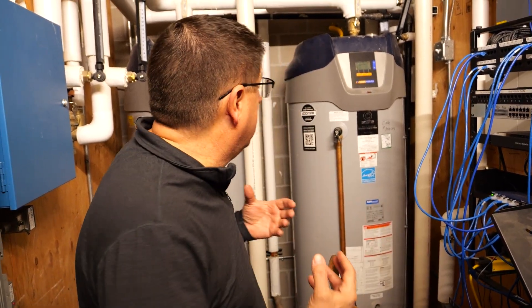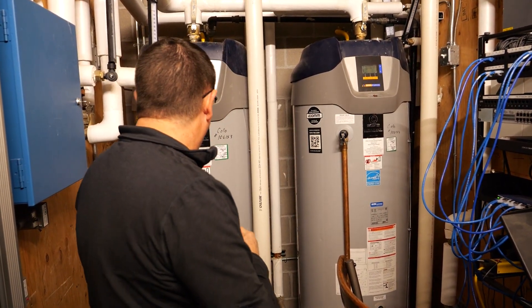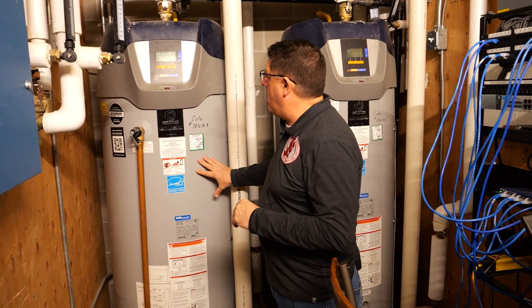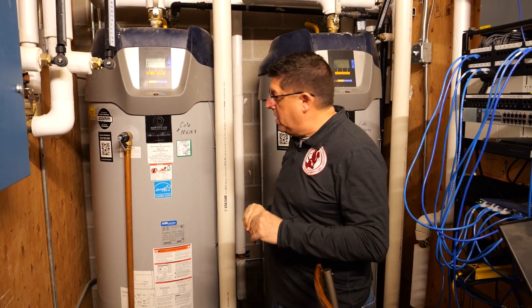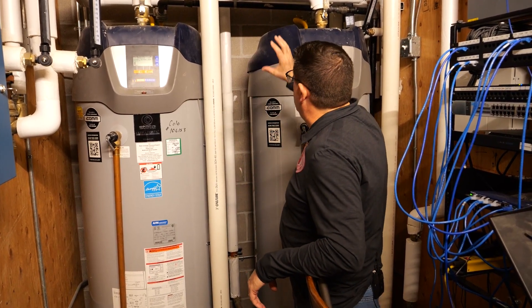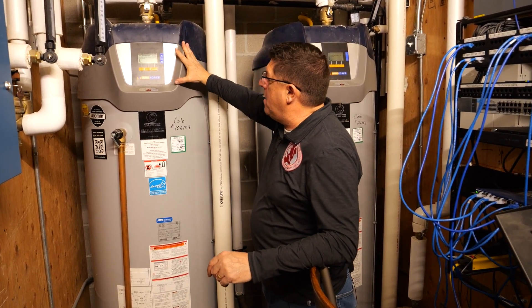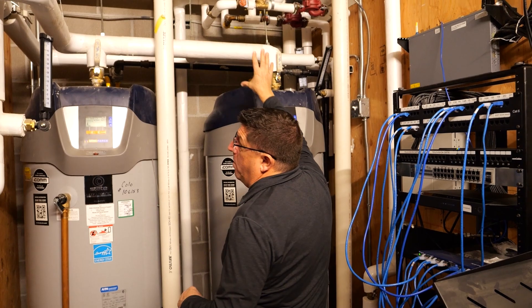When inspecting the plumbing, you should look at the entire system as a system. This is a very sophisticated building. We have two large commercial water heaters, both state of Colorado inspected — they're actually considered boiler inspections. These are high efficiency, commercial grade units. Both are gas, both exhaust through PVC, and both are high temp and ready for operation. They both have circulation pumps moving water around the building.